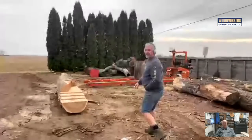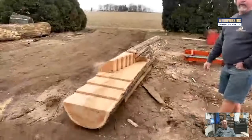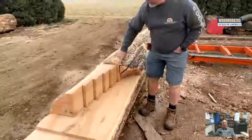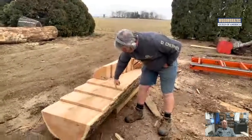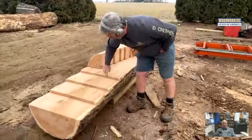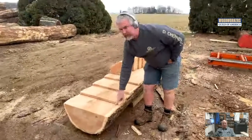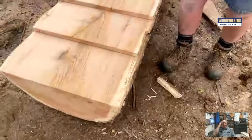We're going to try to go up as far away from the Wi-Fi. This is the quarter sawn sample that I had done this morning. The first cut was skimming the top here. And then I come down into the midsection, where this grain is going 80, 90 degrees to the face of the cut. And I made this cut to get into quarter saw number 2. And then we did number 3 and number 4 and number 5. And you can really see the fleck. Of course, it dried. We'll show it off in another piece.